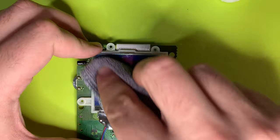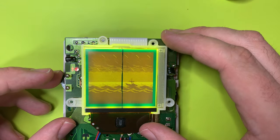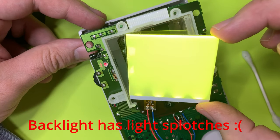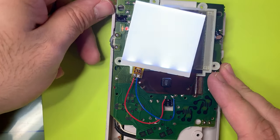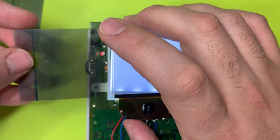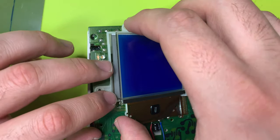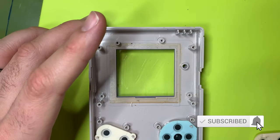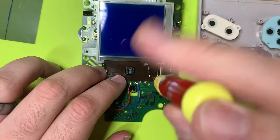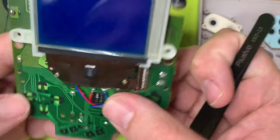Applying some last finishing touches to the screen. We check constantly, making sure everything's functioning properly. There was splotches and light bleed on my backlight — not happy. I emailed Handheld Legend, they sent me a new one free of charge within two days. So I got this blue color going on, everything seems to be working properly and we're ready to go. The final step is removing the protective cover from the polarizer. Make sure the polarizer is oriented to where it's a dark panel instead of the light panel — the dark panel ensures you're getting that 90 degrees to invert those pixels a second time. Clean, clean, clean the screen protector — make sure you've got no dust or debris. Go ahead and place the screws back onto the screen assembly, and hide those wires so they don't disrupt the buttons — use tweezers to pull them into the back of the board.